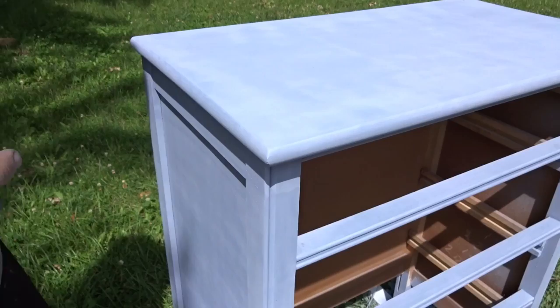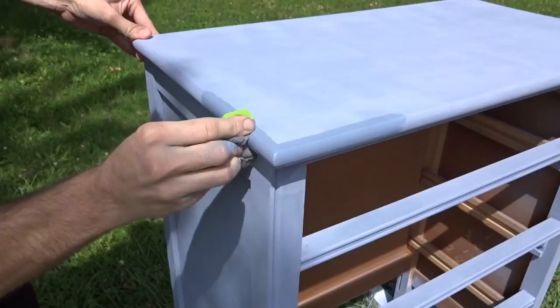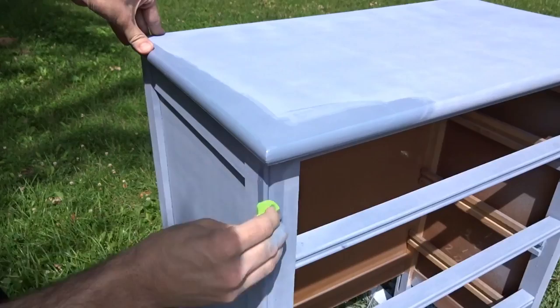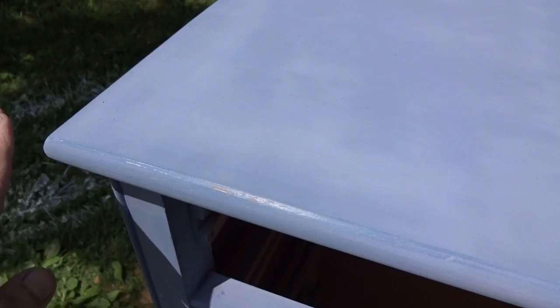After smoothing it out I'll put a second coat on. After that second coat is when I can start distressing. I just added my second coat and it's still slightly damp, so I'm going to try a damp rag first — since it's water-based it should wipe off. That's a gentler version of distressing. Right after you spray it while it's still damp, that's when you can wipe it and it works real nice and gentle — doesn't feel scraped or scratched like sandpaper.